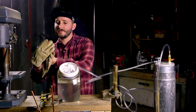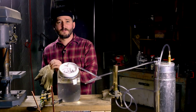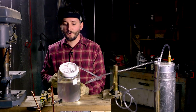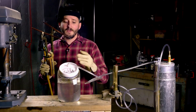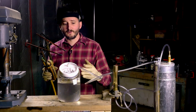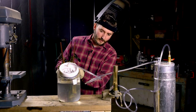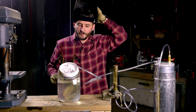My welder is now powered on. In this tank is not distilled water, but rainwater that had some leaves floating in it from a bin outside, so it's going to be mildly conductive. An arc welder does not run at a very high voltage, so the water itself won't conduct much electricity. We'll only start conducting a lot of electricity when I take my torch underwater and touch the two rods together to strike an arc. I'm going to insert the torch — these two carbon rods — through the ports in my tank, and I'll put my welding shield down in case I strike an arc on accident.